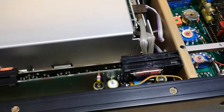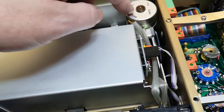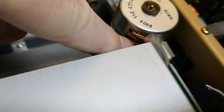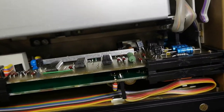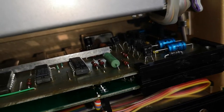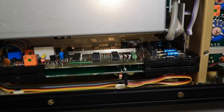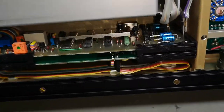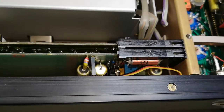I've been looking a little bit more inside. This is the paper feeder from the bottom side — and there's a stepper motor with four wires here and four wires here, going to this board. With a bit of light you can see those transistors here — they drive the eight motor windings. And there will be counters and stuff for the different paper speed feeding. I bet that's what it is.